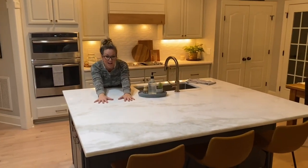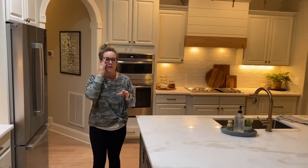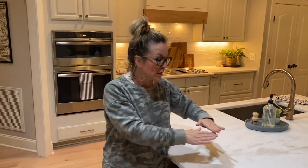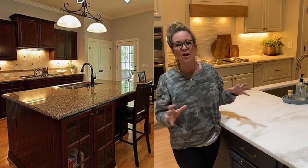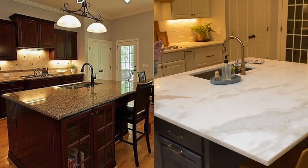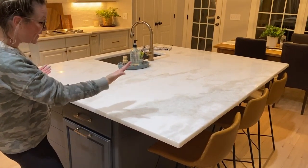This is a marble island — it's gorgeous. A lot of people get scared to use marble because it's porous and they worry it's going to stain. But anything that goes into a natural stone can come out. There's a paste you can put on it that pulls stains out, and as far as etching goes, they can buff that out. So never be scared to use marble — there are always options.